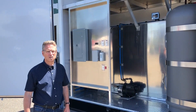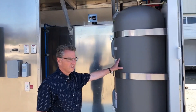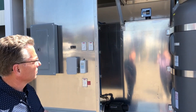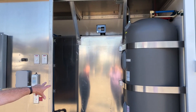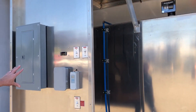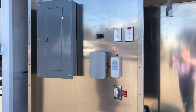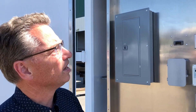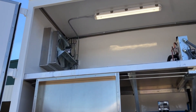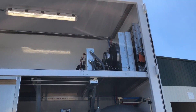This is the mechanical room. Here we have a large hot water heater that gets your water temperature up to 185 degrees, required by the USDA. This is a 500-gallon aluminum water tank with a level indicator. Here is a panel where we have our electrical panel as well as controls for our cooling system. Up top we have an exhaust fan to keep the temperature in this mechanical room at the right level, and we also have the condenser for the cooling system.